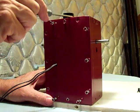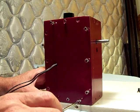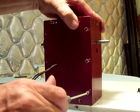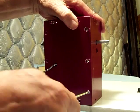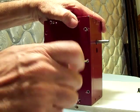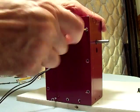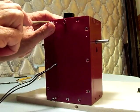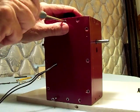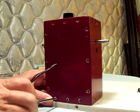In case you were wondering, before I put this on, you noticed a crack across the edge of the top — that was where the fiberboard, which is MDF, medium density fiberboard, split. It's famous for splitting if you don't drill a pilot hole for your screws. I did drill a pilot hole, but you have to have the correct diameter, which is about the same size as the part of the screw in between the threads. All you want biting into the wood is the actual thread that's sticking out, but it's sometimes difficult to find the right bit to get just that right diameter, because then you don't have much thread holding the wood, and on this one it'll just end up splitting. That's the last screw on the back.